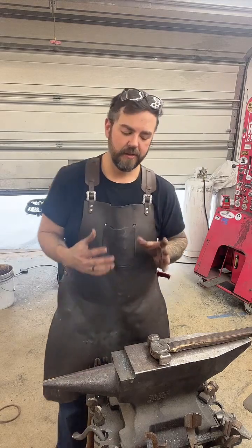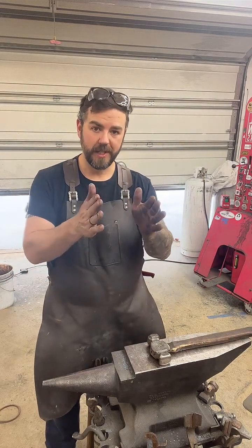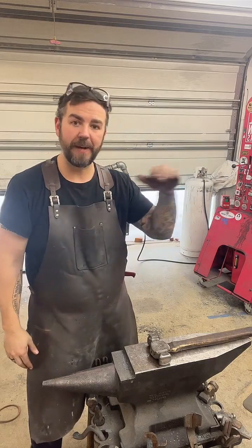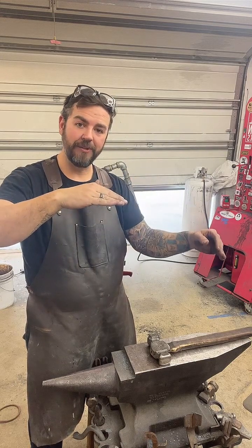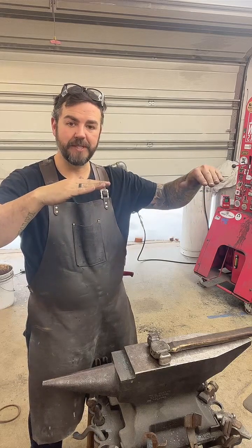Well, with blades, when you start hammering in the bevels, as you bring them together down on the bottom, it's going to bring the spine up. So if your spine's already straight, it's going to turn into a banana. So with a lot of these, they turn them down, the spine turns down, and as you do the edge, it comes up to flat.